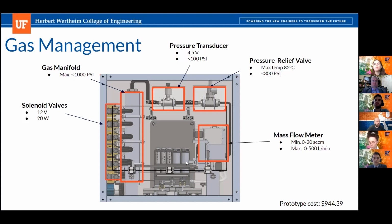So you're measuring the pressure of the fluid in the line, and then the mass flow meter to get the environmental composition. Yes. Is that necessary? Well, we wanted to control the composition of the gas entering the test tubes to perform separate environmental conditions for each one. So based off what the user picks for the gas entering the system, the mass flow reader will regulate what's entering each specific test tube.